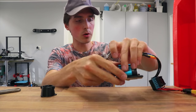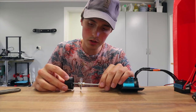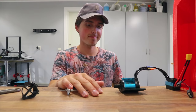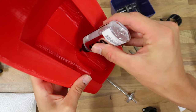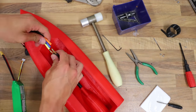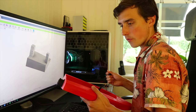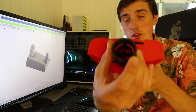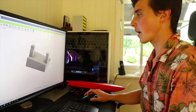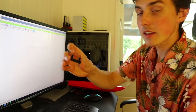At this point we are ready to install the motor into the boat. The shaft is going to be placed in the motor just like so, and the back part of the shaft is going to rest inside that part. For steering, we want the rudder to turn left and right, operated by a 9-gram servo. I had to 3D print a mount for the boat to hold the servo — it's pretty nice.